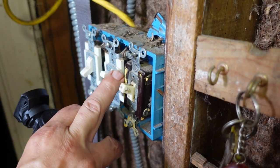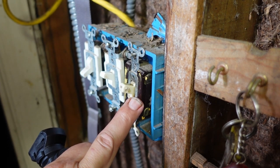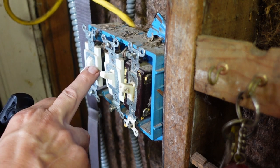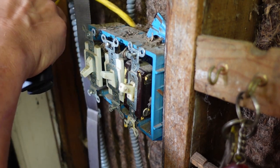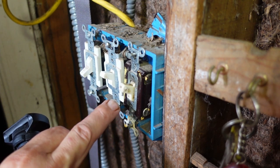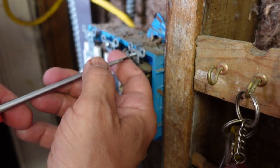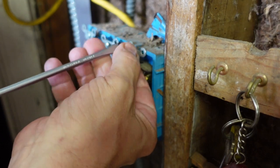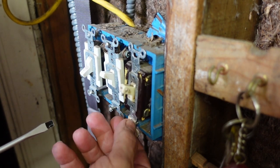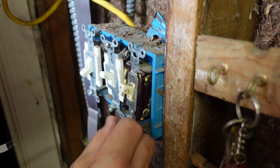It was one of these two switches that made all the sparky things. I'm going to take a meter and see if there is any voltage on these. I'm guessing this one is probably the worst off. I think this one is not even connected to the knob and tube wiring — it's connected to the Romex. This one I believe is the knob and tube. I'm going to verify that. And yes, I know the house wiring is atrocious — the previous owner liked to fix things but didn't necessarily know what he was doing.